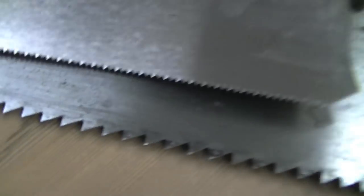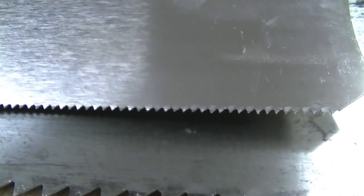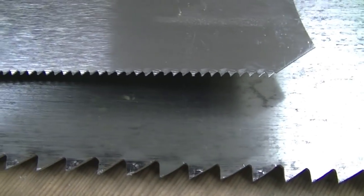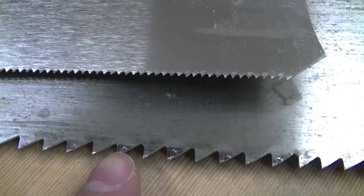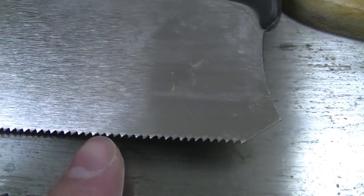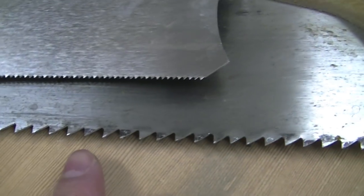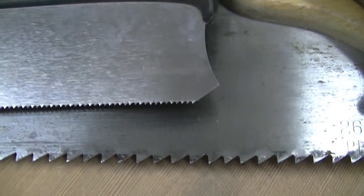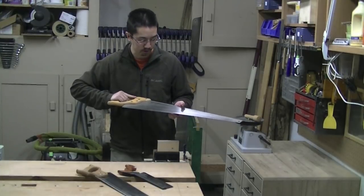For comparison, here's a finer tooth saw — a 14-tooth dovetail saw. Looking closely, we see the same style of geometry, but this one has a negative hook angle, meaning it'll be less aggressive in the cut. The coarser saw will tend to dig in and grab, while the finer one will tend to lift itself out of the cut. The trade-off is that the finer saw is less aggressive but requires more force to push through the cut. This coarser one happens to be a rip saw.